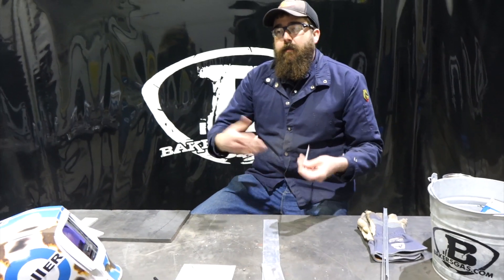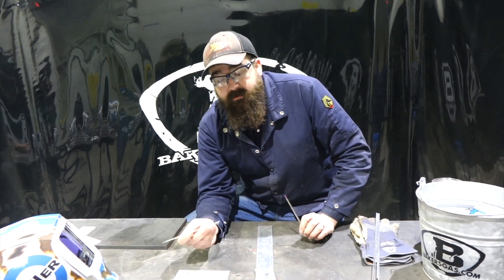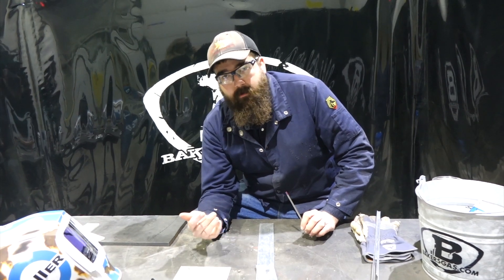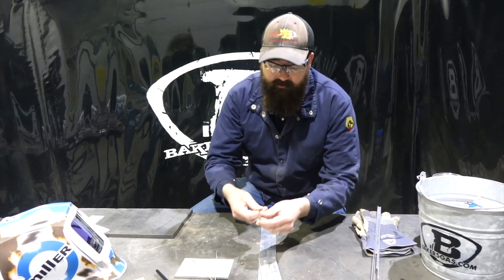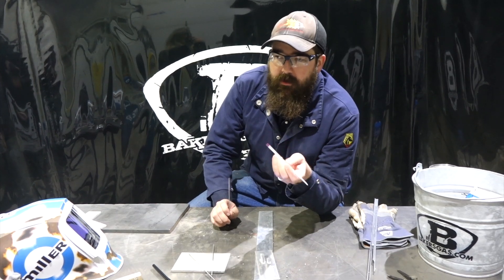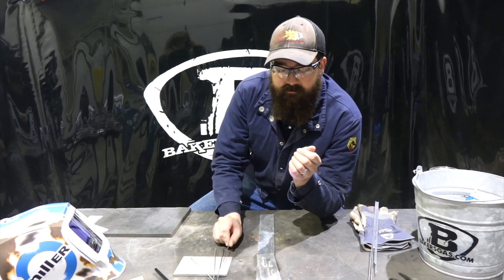The way this works is the emission-enhancing oxide added — in this case cerium — lowers the temperature at the tip. This slows grain growth in the tungsten and creates a longer life for that tungsten. With thorium, it's still a high-temperature situation and it's just not going to last as long as a ceriated tungsten.